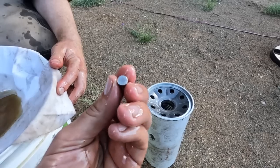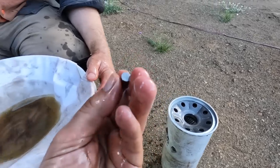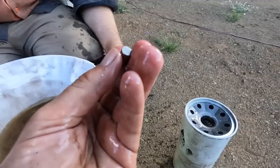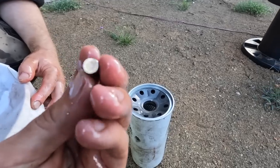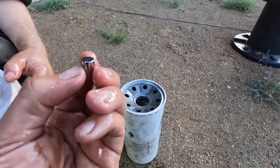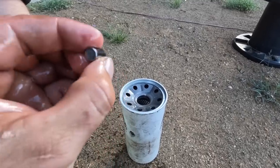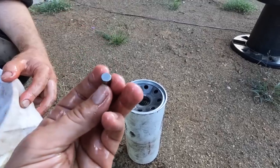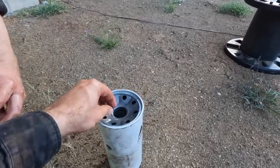I'm imagining that possibly, well, it would just about have to come from... We'll have to trace that hose. Yeah, back. Well, it might have to come from the pump, because that's not making sense, what it's doing. Because if it was a motor that died, it wouldn't keep trying to drive itself forward when it was in neutral. But anyway, definitely something is not good. So we've got to keep looking. But anyway, that's where we're up to at the minute.